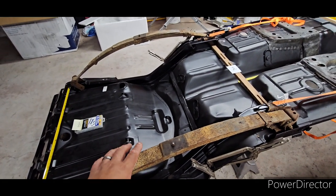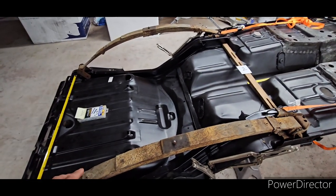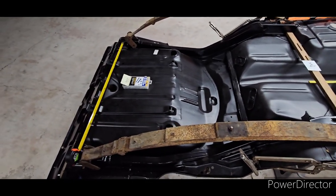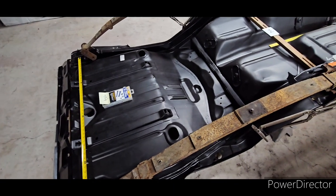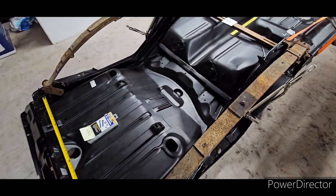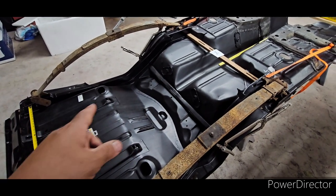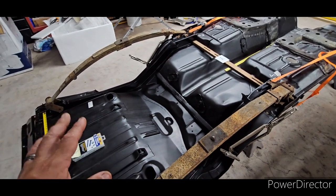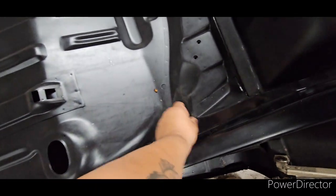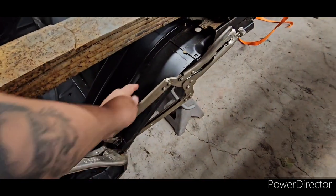But I always go back to basics — what do I need to do? I know I have to have everything correct to put it back together. So use the stuff that was on the car. You're putting original suspension on — well, if you don't have the original stuff, make your order of leaf springs, place them down, because you're going to be bolting it back down eventually. Get your rear frame rails to fit. And by the way, those are the eBay special rear frame rails — they fit beautiful, nice and tight.